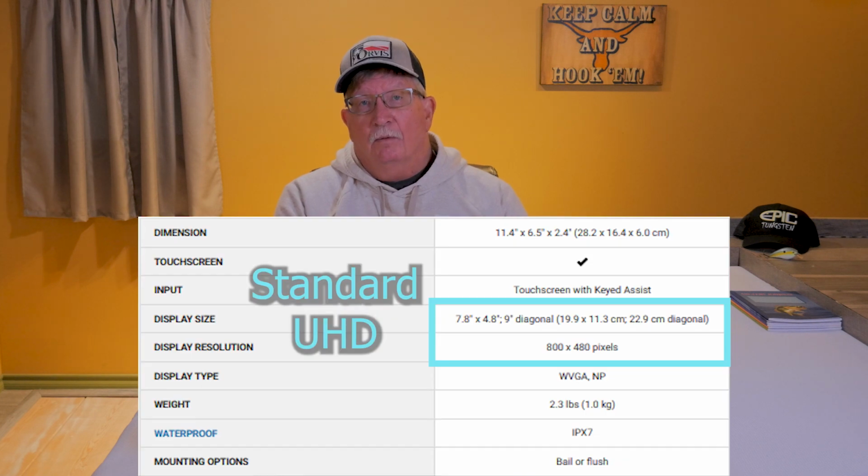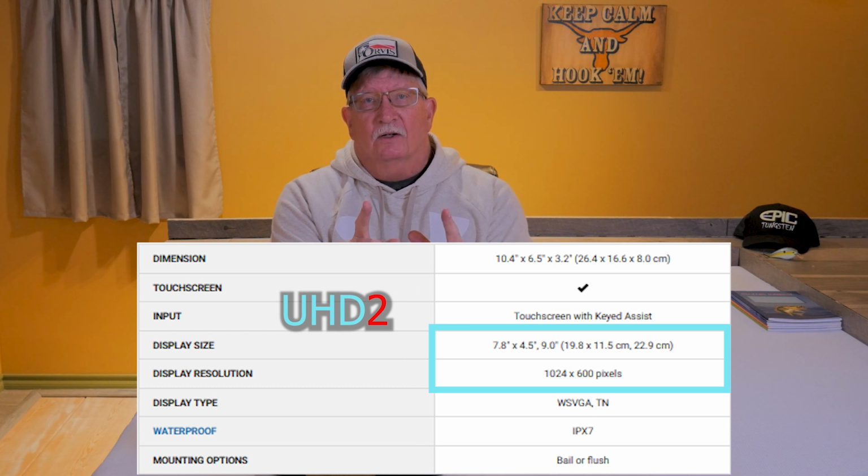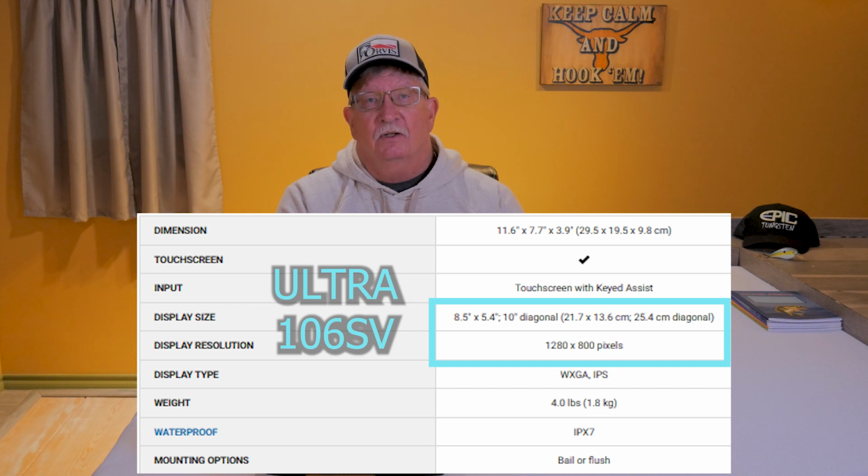Your laptops and things like that, like I'm using right now, the graphics card is my main draw. So with the higher speeds and greater resolution, the screens are gonna generate more temperature, and the unit's gonna generate more temperature internally. The other thing is the screen resolution itself. I know Garmin's newly released UHD2 is quite a bit wider than the old unit, and I would assume that's because of the internal processor and having to have more heat dissipation inside the unit.